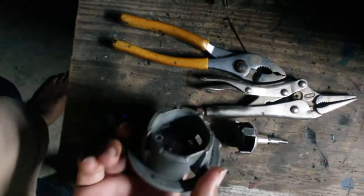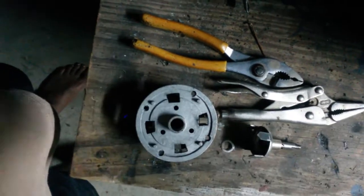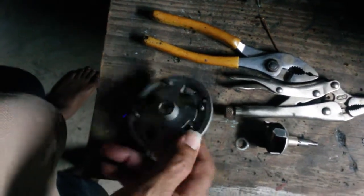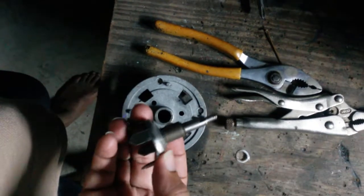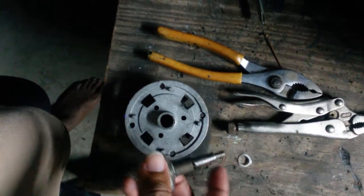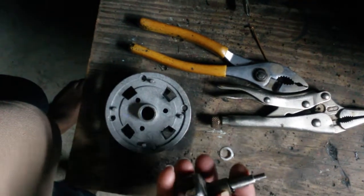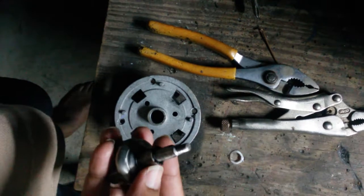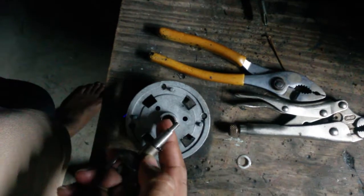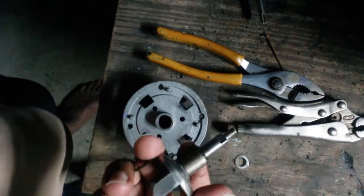Quick review of this housing — there were four pegs fitting into four holes, with two screw holes going from this side into the sheet metal. I initially thought they had pressed it in, but after popping it out and taking off this little plastic washer — which is more of a dust guard — I realized it actually had a circlip. So this part is not meant to rotate; this itself rotates. It looks a bit like a bronze bushing.